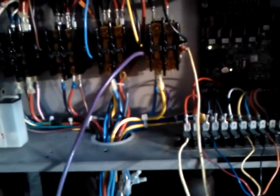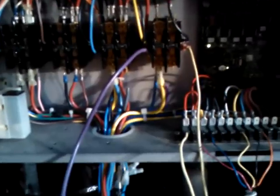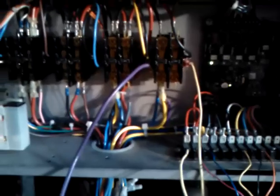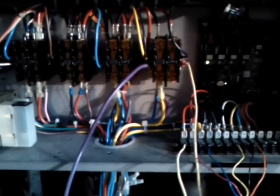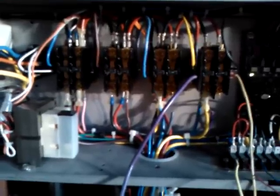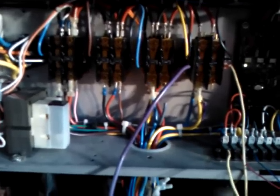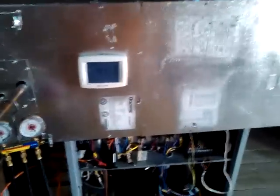What we started to notice was we had resistance across the right side — the L2 to T2 side of the contactor — and not across the left side. If I shut this down and push it in and ohm it, I can see I've got zero ohm resistance across the left side. This setup, after running in my customer's house for about two years, has on the L2/T2 side of the primary two compressor bouncing resistance all the way around 40 to 60 ohms and even higher — it just bounces all around. The primary one contact on the right side didn't bounce quite as high, but still anywhere from 10 to 20 ohms. What's interesting is even though the left side is constantly flashing, that's reading zero. So the dual potential relay setup authorized by Bristol is failing at a huge rate.